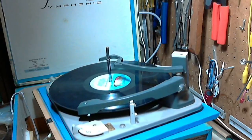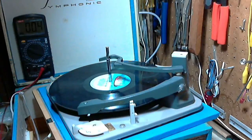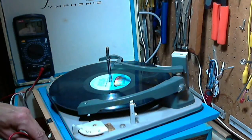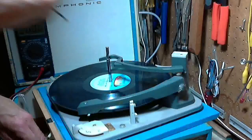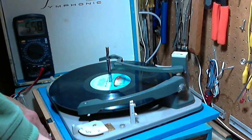Okay, so switch off, power on. And I would really be quite shocked if this shows a voltage. So I'm just checking it to power system ground. 55. Okay, so what's going on with the software here? It's asking me if I want to close it. No, it all seems to be running still. Yep. Okay. Man, it just keeps getting weirder and weirder in here. So 55 happens to be exactly half of 110 for those of you who are into math, 110 being the supply voltage.